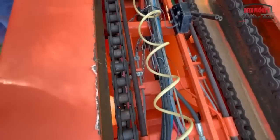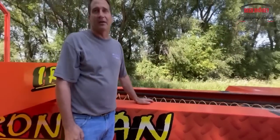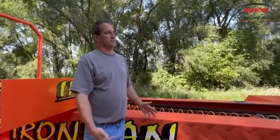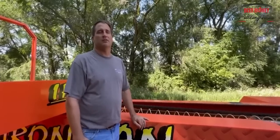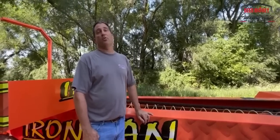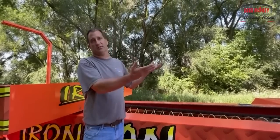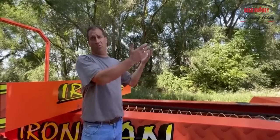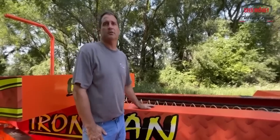And that helps so that when you get down on the big end, so to speak, you have the weight of the axles working with the sled, more weight for stopping. So it's not momentum that causes the wheels to come up? You're actually physically pulling the wheels off the ground. We are pulling the wheels off the ground because we have the axles sucked up tight to the frame, and it's all one unit then. So the axles do not move.